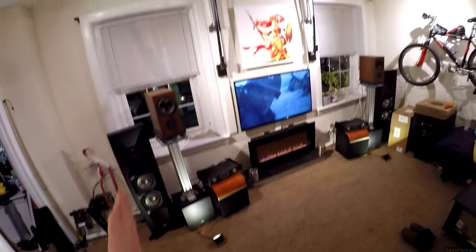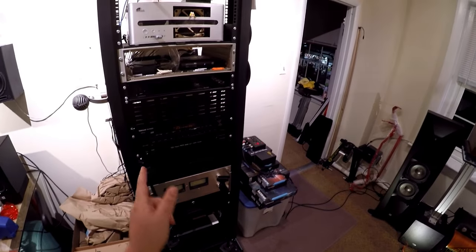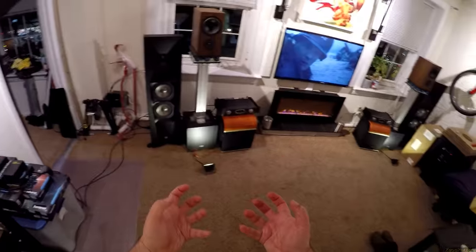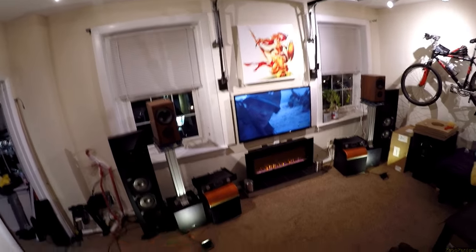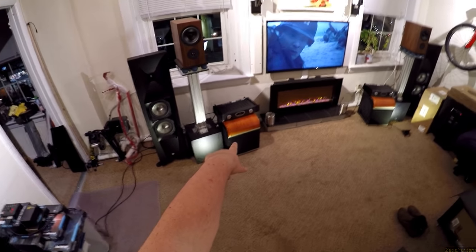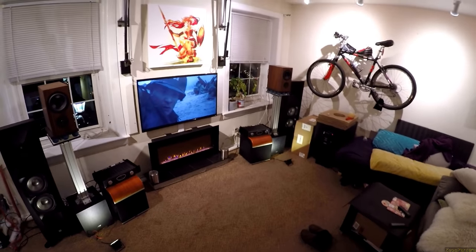I said, these can't do a home theater. Turns out, I was probably clipping the amplifier in the Tascam, because it's a good amp. It's a $1,000 receiver. But it was still not enough balls to really get these up in volume without cone breakup from bad power. So now that I have lots of power per channel, they play loud.